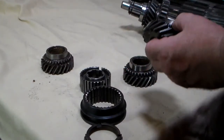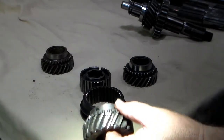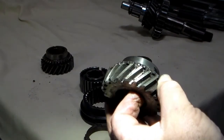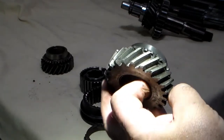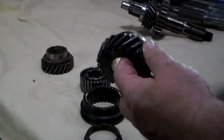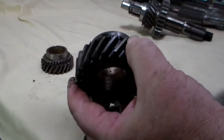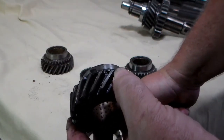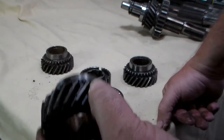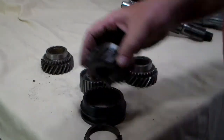Now this one — can you see the rust pitting along this gear? This gear has rust damage beyond use; you would not want to try to put this into service. A lot of people say those little rust holes will just slide past, but the answer is wrong. When you've got those rust holes, that chromed or slick edge along the gear — as the gears slide against each other, every time that front surface edge comes around it chews into the other edge. Any pits in there will chew up the other gear, and then you've got two gears chewing into each other, which is going to destroy everything.